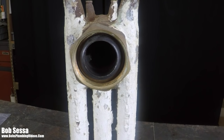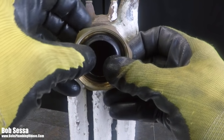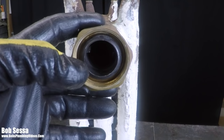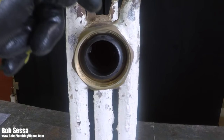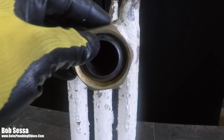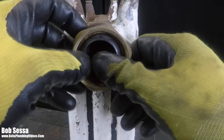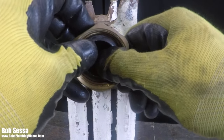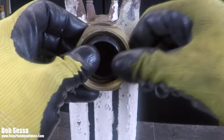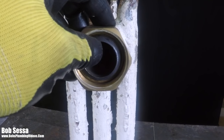And that's my recommendation on how you go about stopping a leak if you feel that you have cut too deep into a fitting or into the radiator. And I will tell you that it's pretty much bulletproof. It's worked for me. It's a very rare occasion that I had to actually change a fitting or replace a radiator. The blue block does the trick. The key is, if you can let it set for 24 hours, you're going to be in shape.